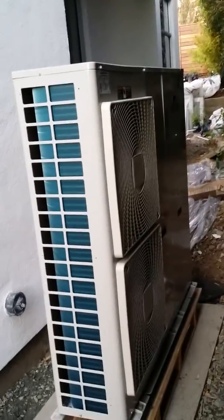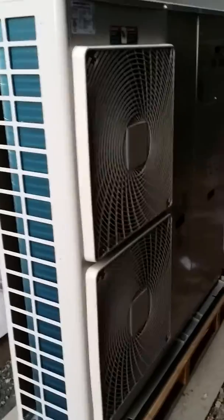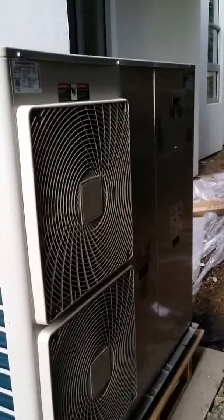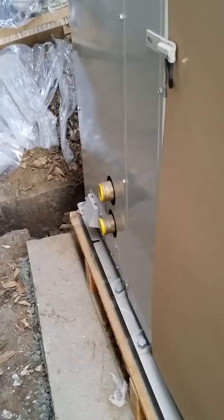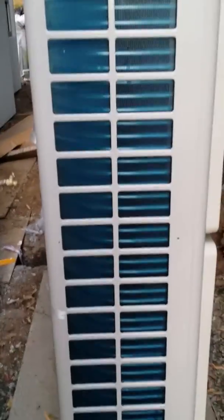This thing took about six guys to move it over here from the garage and it weighs about 400 pounds. Sorry I don't have a better angle, but you can see we have condenser fans, an inverter compressor inside, a heat exchanger, and controls. This is called a mono-block — an all-in-one unit. Right here are our tap-ins for our water lines; these are inch-and-a-quarter brass. And these are our heat fins, which extract the heat out of the air, and these are the fans.